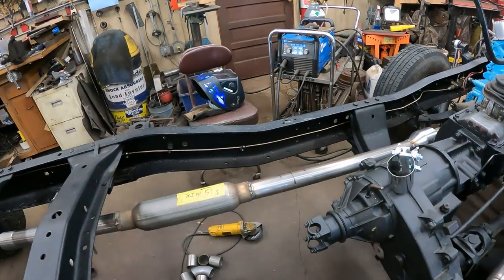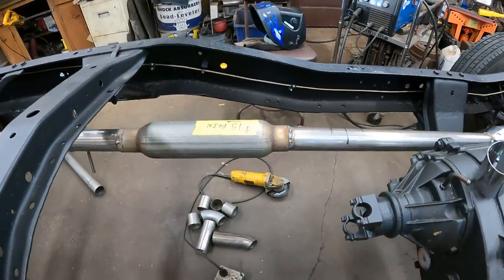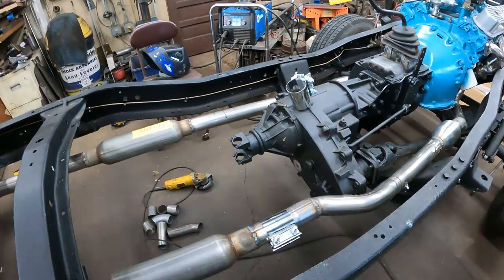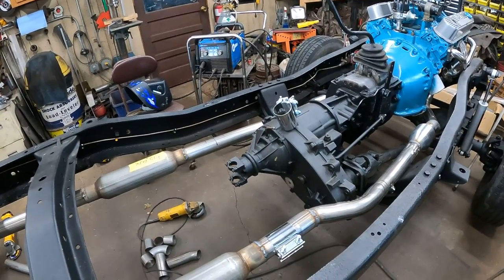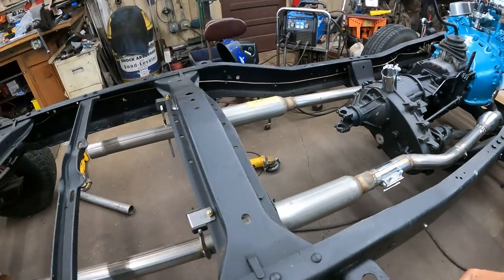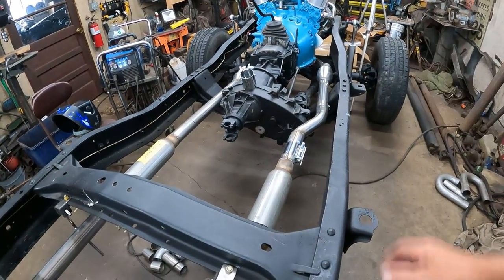There's no crossover pipe. I could have put a Y pipe in down here under the drive shaft. I know they make more power and scavenge and all that stuff, but I've built a lot of dual exhausts and never ran an H-pipe. I'm not making huge horsepower on a race car, so it's going to be fine. That's going to do it for the exhaust system. It's all set. Thanks for watching.